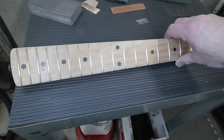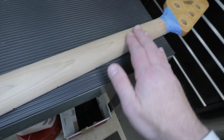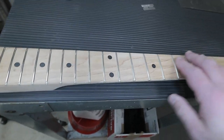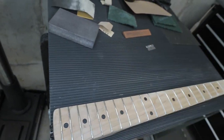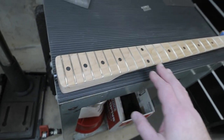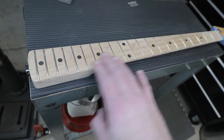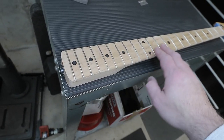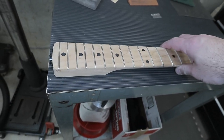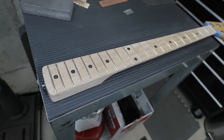It was completely gray. Literally the backside of this, it looks much better now, but I've been sanding it and scraping it with the razor blade. I'm hitting it with 240 right now, but I plan on finishing it off with 240, 400, 600, and possibly 800. And then obviously give it a nice coat of tung oil or linseed oil, or whatever I figure out is going to be the best bet for unfinished maple. So this is quite the project.